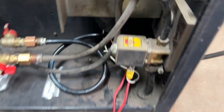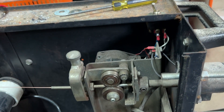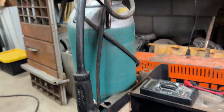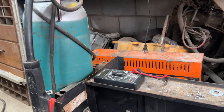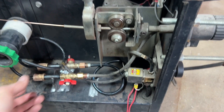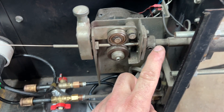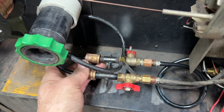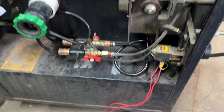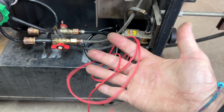When I pull the trigger, the solenoid is clicking on and off. So now I have my argon mix — 75/25 argon/carbon-dioxide — set up to MIG weld steel. This welder is now back to the way it was made. I have this line going up through the original gun and the spool gun gas line is closed. So we're back to how we started.